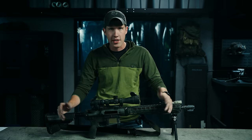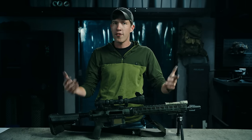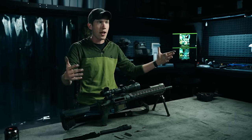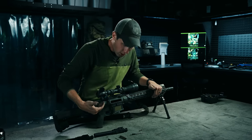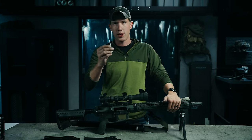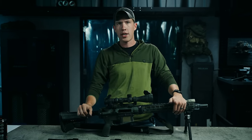We're putting it on top of ice, and even when I go to pick the gun up, it's still generally warm. There's not enough, in our opinion, temperature change there that's actually going to affect the metallurgy of everything on the gun, especially not the firing pin. That's protected by the upper receiver, that's protected by this giant bolt carrier group, and then inside is the firing pin itself. So we don't believe the ice is what caused this break right here. It's most likely other things.